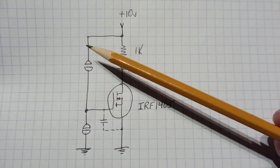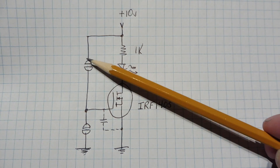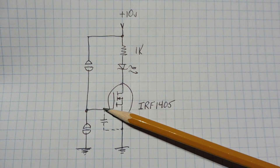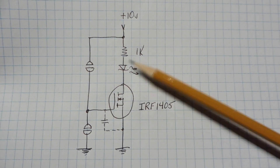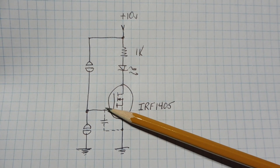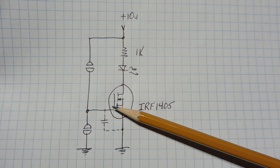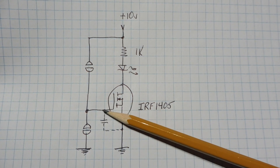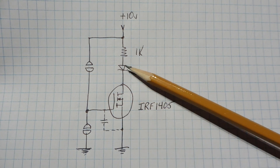This is my on touch pad and this is my off touch pad. When I bridge the on touch pad I'm feeding voltage into the capacitor — charging up the CISS capacitor to 10 volts — which turns on the MOSFET and the LED comes on. When I release my finger, that 10 volts is trapped on the capacitor with no way to bleed off due to the high impedance of the MOSFET. The LED stays on until I touch the off touch pad, which drains the voltage off the capacitor and turns off the MOSFET and LED.